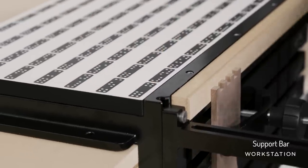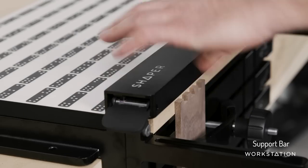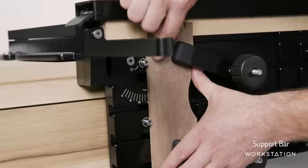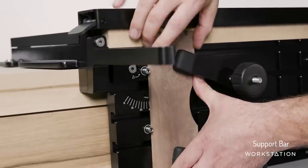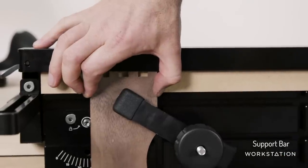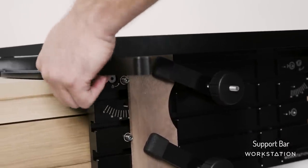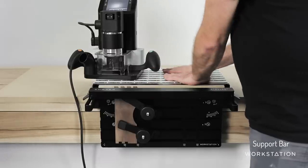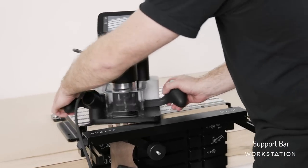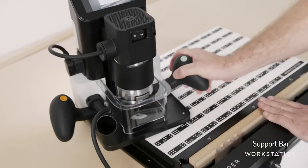Notice these little mounting points here — they're designed so that the support bar attaches and gives you a very clean reference height for zero. We can keep these two points engaged and push it up, and at the top you get a very confident zero point. Now that we have our plane set up, our support bar is coplanar with our tape field. We can confidently run Origin across here without cantilevering out or hitting any bumps, which enables us to accurately and precisely cut throughout.